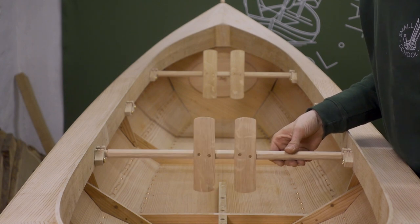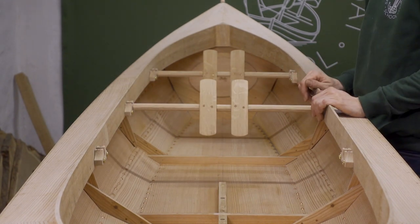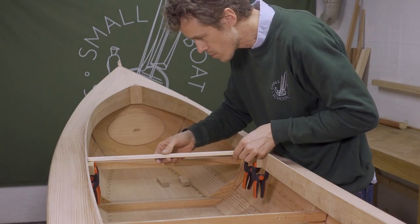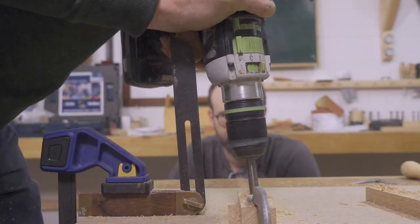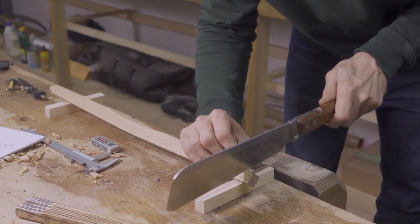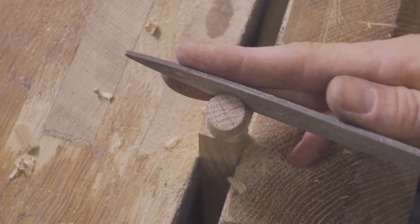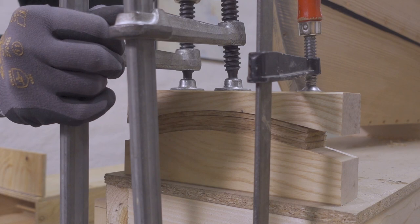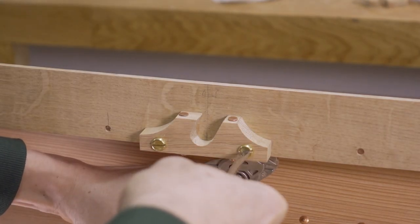Here I'm making the backrests for the canoe. I'm building the long 14 and a half foot Fiddlehead, so I need to make two backrests that can be placed in three different positions, so the boat can be paddled either by two persons or single-handed. First, I'm positioning the brackets correctly on the coaming. This will help me determine the angle of the hole I need to drill for the backrest. Then I'm drilling the holes and cutting out the shape of the brackets. They get a copper rivet on each side for added strength. Here I'm making the support bar for the backrest, rounding off the ends with a chisel, rasp and sandpaper. Then I'm making the pads for the backrest. I'm steam bending them in a form to make them slightly curved, then attaching the pads to the bar with screws and glue. To finish the backrests, I'm bolting the brackets through the coaming sides and the long carlins.